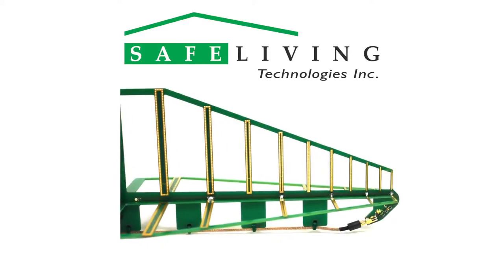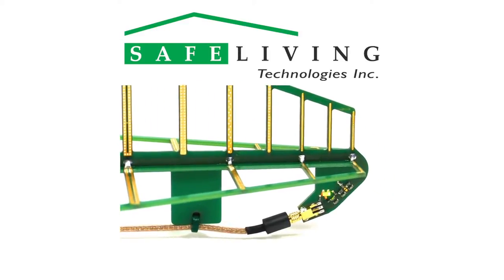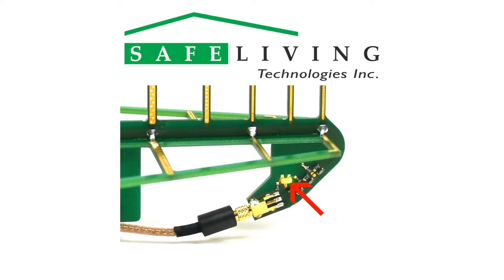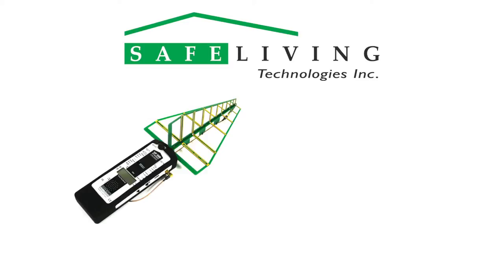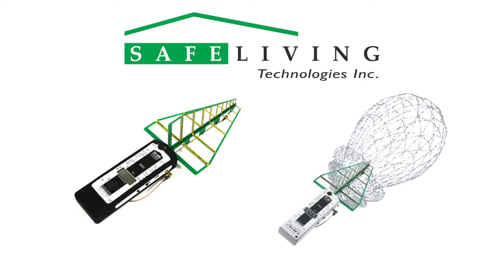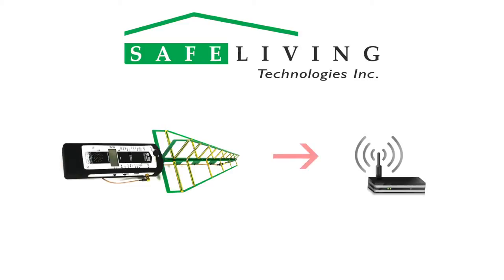When the log-periodic antenna is properly connected, you will again see a red and green light, indicating the same connectivity and functionality. The log-periodic directional antenna measures in the direction that you are aiming. If you could see its detection pattern, it would look like a focused forward beam. With this directional pickup pattern, this antenna's best use is to identify the direction of a radiation source.